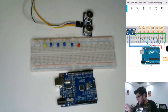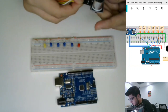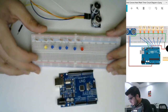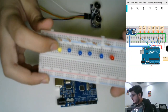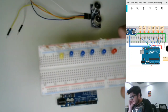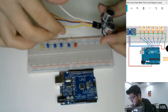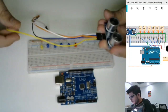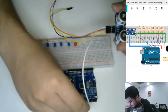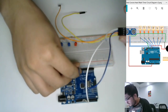For the wiring, we have the HC-SR04 ultrasonic sensor, which has four pins: VCC, Trigger, Echo, and Ground. I've connected jumper cables to it and already placed the LEDs on the breadboard along with the resistors — the negative terminal of each LED is connected to one end of a resistor, and the other end is connected to ground. Let's wire the ultrasonic sensor first. The VCC pin goes to the 5V on the Arduino, and the Trigger and Echo pins go to D12 and D11 respectively.